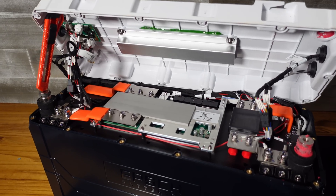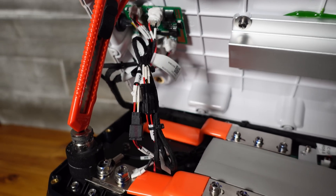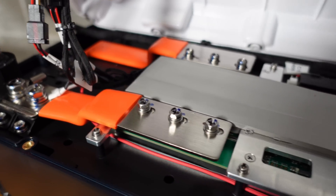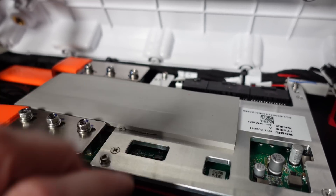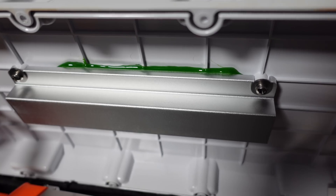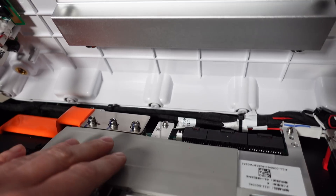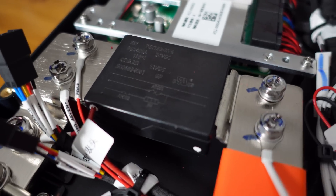This battery is insane inside. Look at all the communications cables on both sides of this battery. Look at the size of these bus bars coming off the BMS — they are huge. This gray thing is a large thermal pad on top of the BMS, and that metal piece located right here is actually a gigantic aluminum heat sink. It's sinking heat from the BMS inside the battery to the outside of the case to help cool your battery. And look at the size of this fuse — that thing is massive.